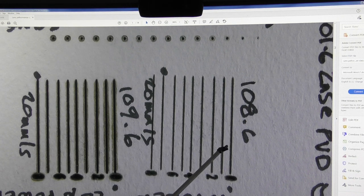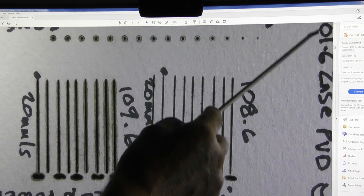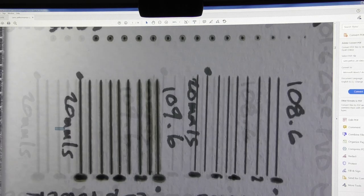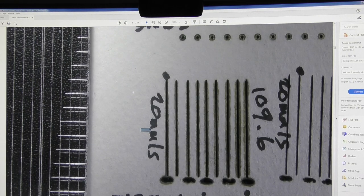You can see here, it's slightly difficult to do on this one because at a very long focus, we've got a very large range over which not very much is taking place. But if we start looking here again closely, we'll see that we've got some radiusing on the edge, some scorching on the edge. This is where I think the beam was set to its optimum intensity focus. But there is another part to the diagram as well.